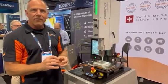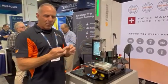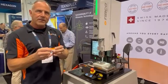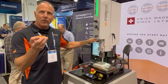We do hermetic seals quite often. The nice thing about ultrasonics is that it reports how much part collapse, how much energy, how much power, what the frequency was, what the weld time was. All of these pieces of information are stored in the machine and we can set upper and lower limits around it so that it can flag a good part or a bad part.